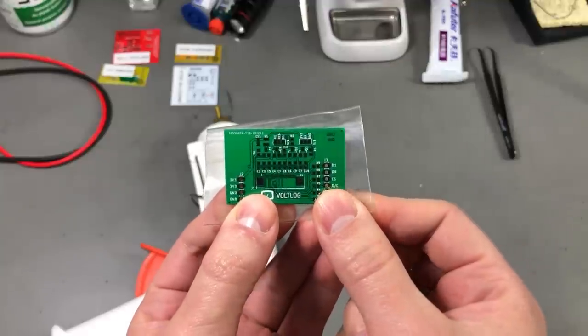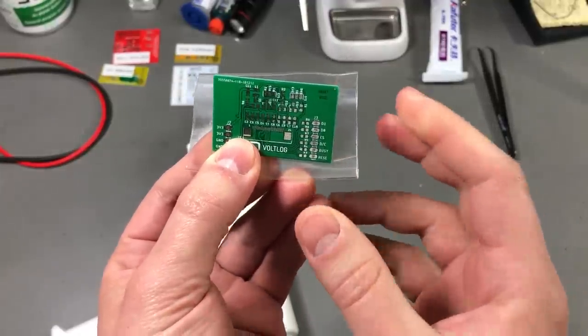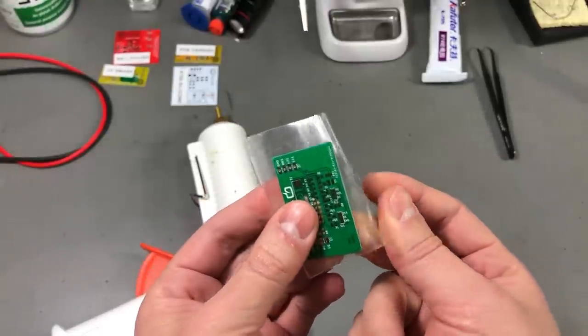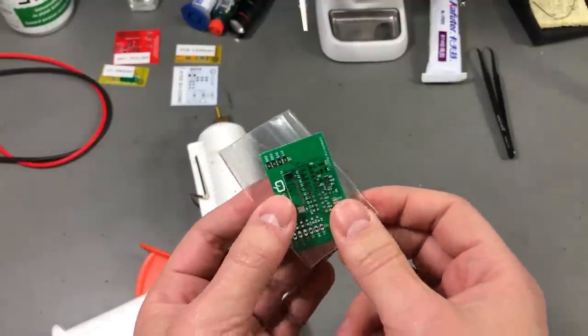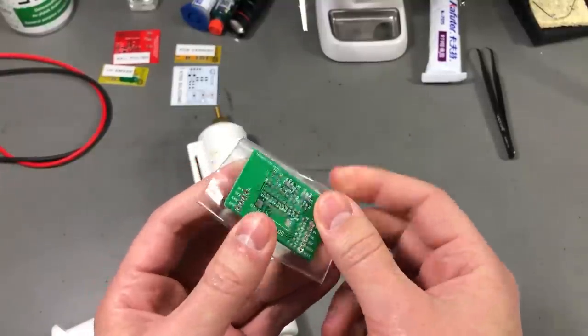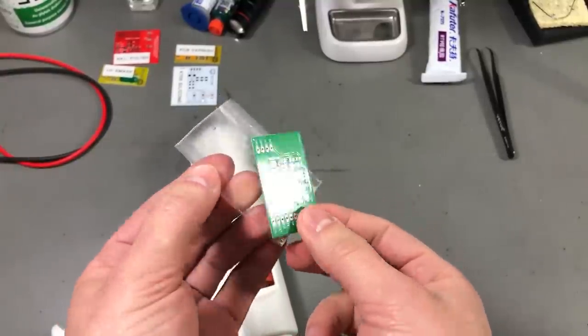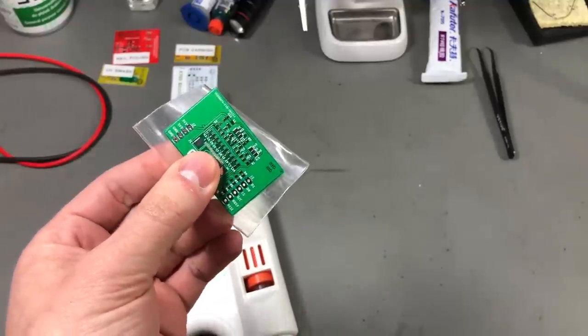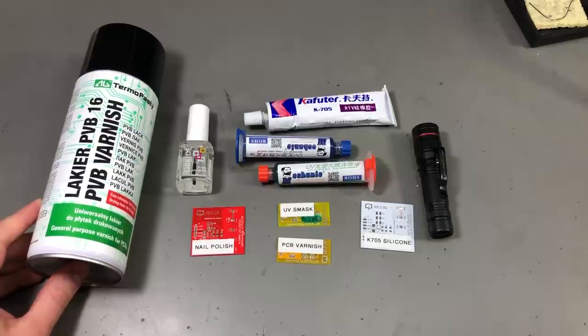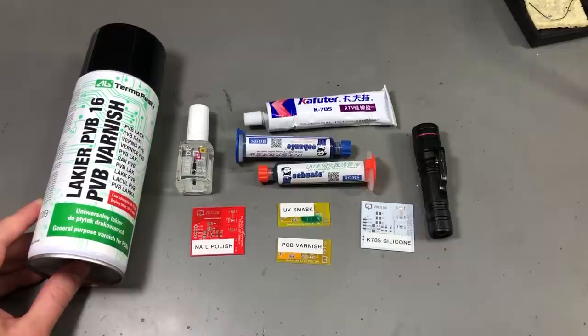This kind of works but depends a lot on how well the hot glue melted and flowed to cover everything on the PCB, and also depends on the properties of the hot glue, which is not really an ideal barrier against water or other liquids. So in general I tend to stay away from this method and use the others to protect the PCB. These are pretty much the methods that I use for protecting my PCBs from the environment. I would like to hear some feedback in the comments below — what do you think of the methods I am using, and also I would like to hear about other methods to protect PCBs from the environment. Thank you for watching and I'll see you next week.